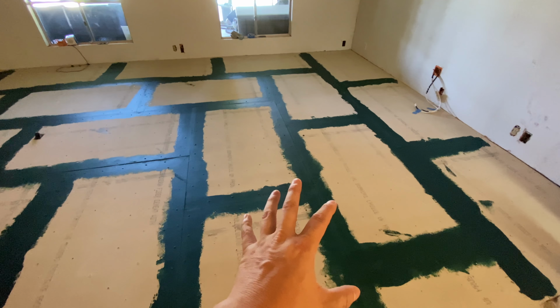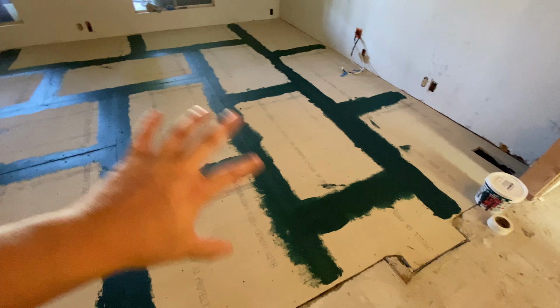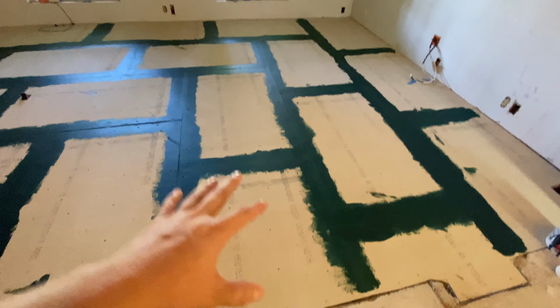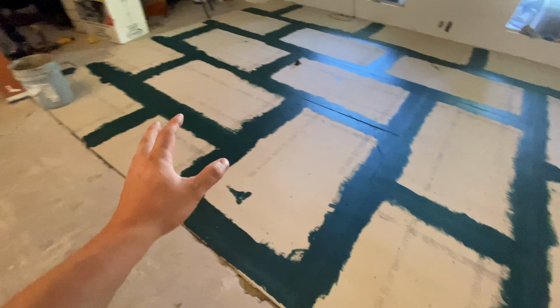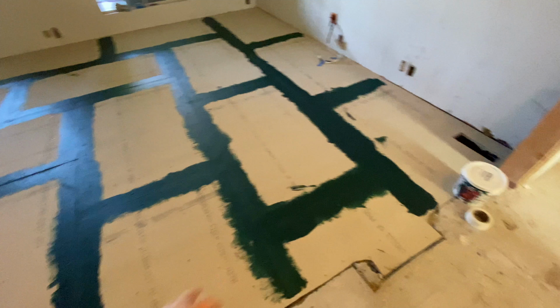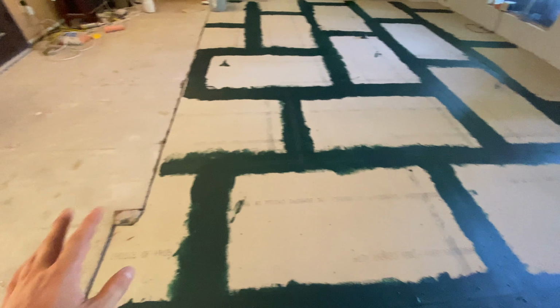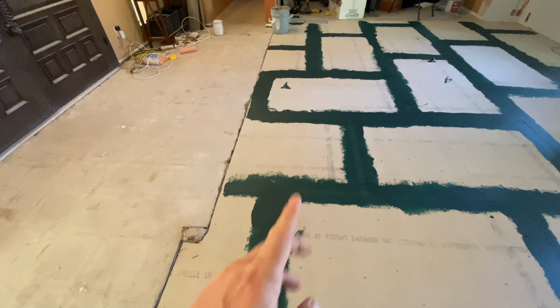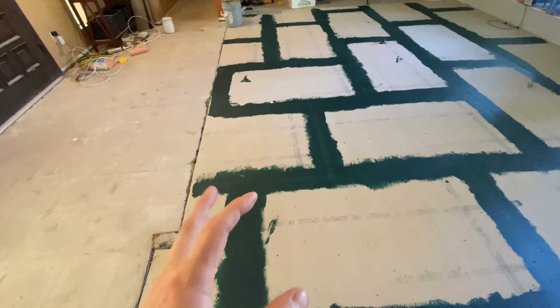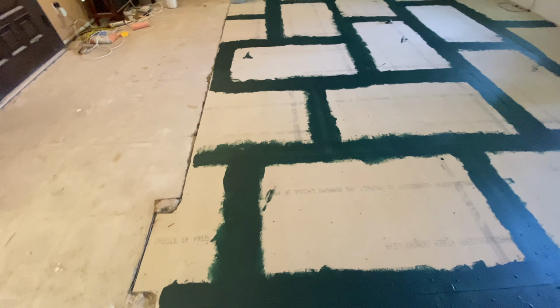So there's a frame underneath it, which is done at a very specific height, and then plywood on top of that. On top of that, there's a layer of mortar with cement board, the half inch Hardie Backer stuff, to make it really super hard, so that when we put the tile on top, you're not going to be able to tell at all. It's not going to be flimsy. The grout's not going to crack, hopefully, because it's going to be really solid, even though 2 inches underneath, it's going to be a wooden frame.